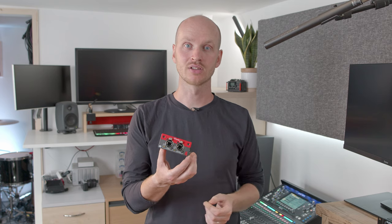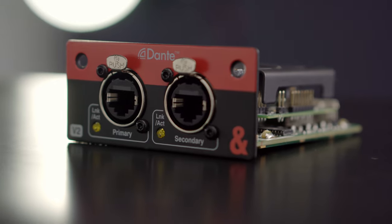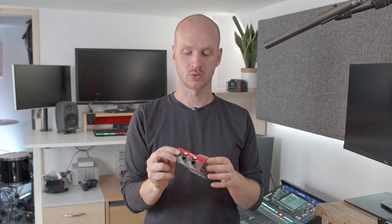There are protocols that allow you to connect third-party systems together. One of the most common would be a system called Dante — a digital audio network system that allows you to connect devices from Allen and Heath to other manufacturers, all using the Dante protocol. If your system works on Dante audio networks, it will integrate with any other manufacturer also using Dante. To use something like Dante you might need to add a card into your mixing desk. This is the Dante card for the Allen and Heath SQ series — most manufacturers will have a card available for Dante, Waves, or other audio network types.